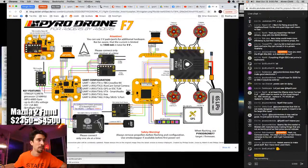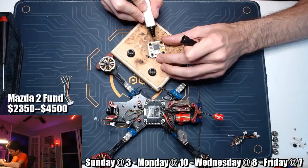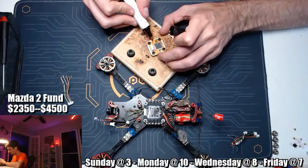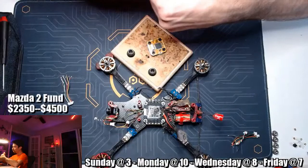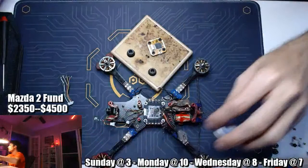So let's get all of these tinned up. That'll probably work better. We're going to put a little flux on the pads that I want to tin. There's the camera signal and these three guys. I'm actually not going to tin these because they're through holes. I'm going to wait until the wire is in there and then add the solder to use the actual through hole. Through holes are kind of a pain in the ass, but they're very strong. So if you're good enough at soldering, I do recommend that you use them because you're going to get a little bit of extra strength from using them, which is really nice.